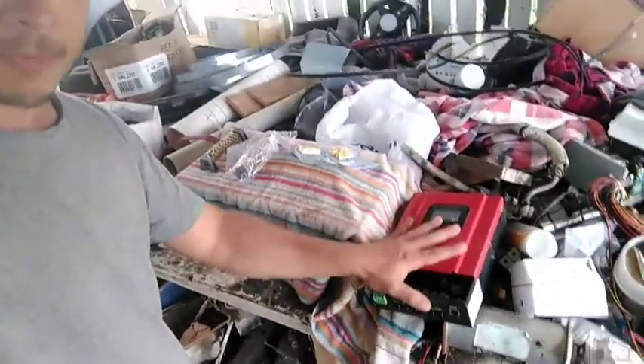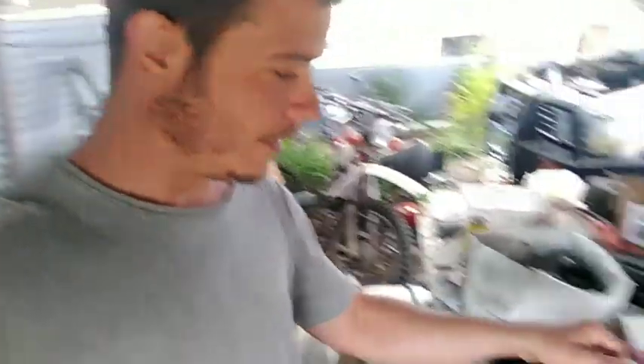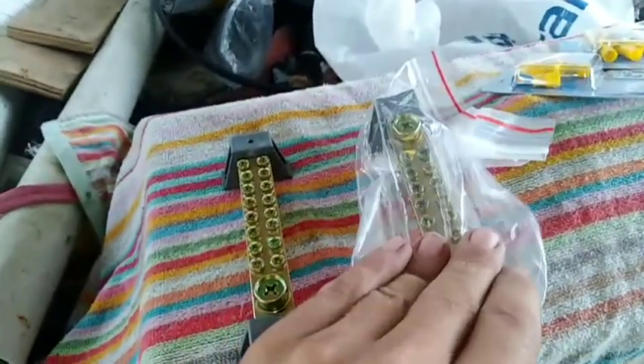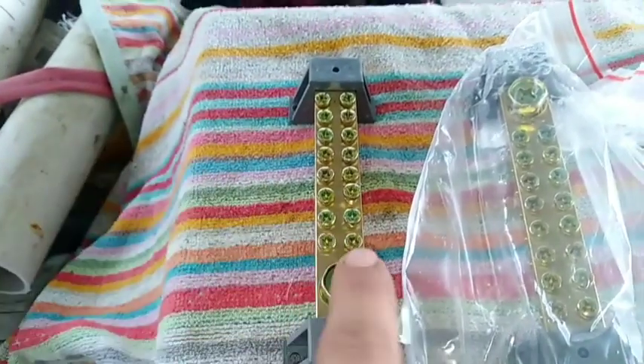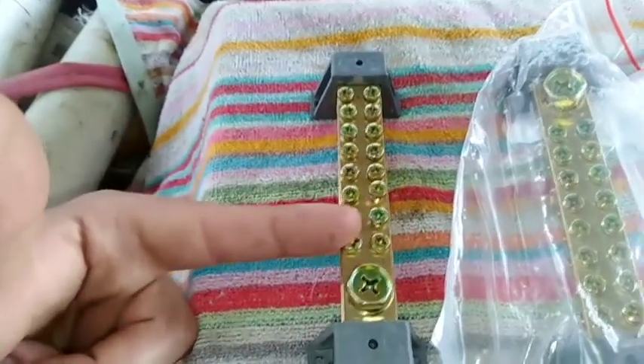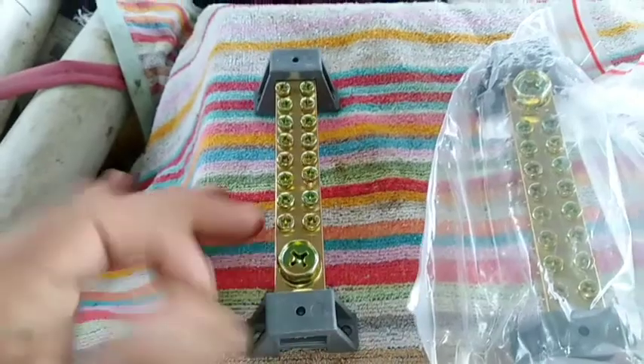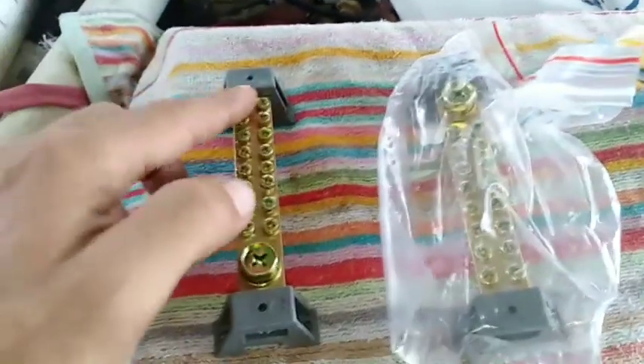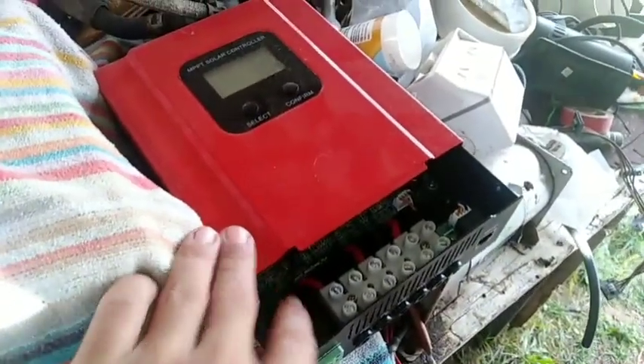So that's the charge controller and circuit explained. With your busbars, each panel — you have a positive and a negative busbar. We've got eight slots, and all your negatives go into one, all your positives go into the other. Then you have two cables that run over to the charge controller, which has two cables that go down to your battery bank, and from the battery bank it goes to your inverter. That's all the theory done — now let's get into some actual wiring.